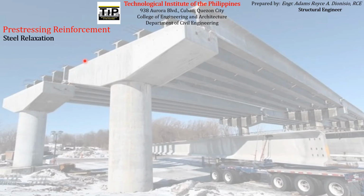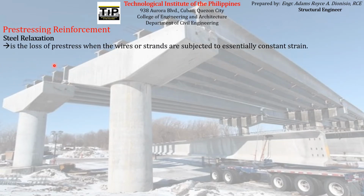Steel relaxation. What do you mean by steel relaxation? This is a problem naturally experienced by steels, especially steels that are pre-stressed or used as pre-stressing reinforcement. It is the loss of pre-stress when the wires or strands are subjected to essentially constant strain. Steel relaxation is a scenario wherein the pre-stressing reinforcement loses a certain magnitude of pre-stressing force, or pre-stress, due to steel relaxation.